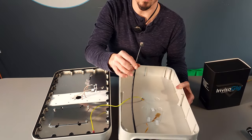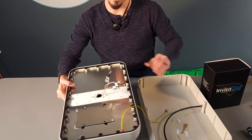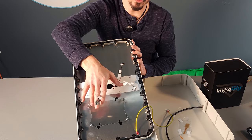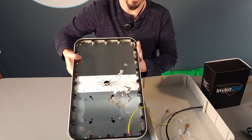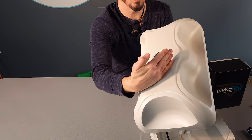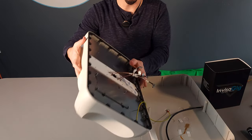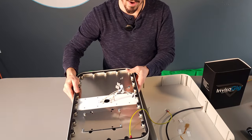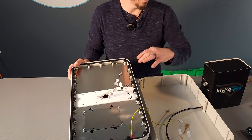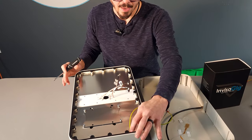There is also the tail for the RJ45 bulkhead where your Ethernet cable will go in. The antenna is actually two separate antennas inside this enclosure with two antenna cables per antenna set. They are cross-polarized at 45 degrees, matching the shape on the top side of the antenna — one antenna here for two pieces, and one antenna here for two. They are electrically separated as well.